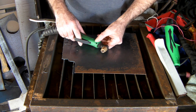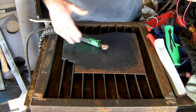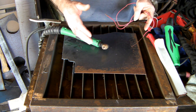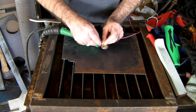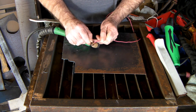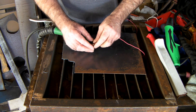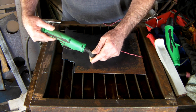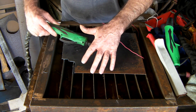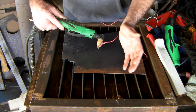To turn this torch into a pilot arc torch, it's quite simple. I've actually got a more in-depth video on this — I'll put a link in the description below. Grab your piece of wire, wrap it around the nozzle, and put it in a bit of a noose so it can slide on and off. These are contact tips designed to run along steel, so we can make it pilot arc just to start and burn through until we touch the steel — then the wire is no longer needed. I only use this to start when cutting rusty or ugly steel.